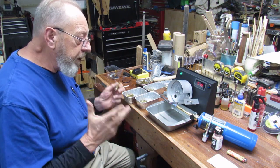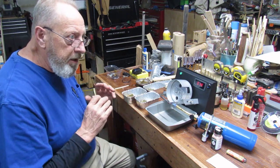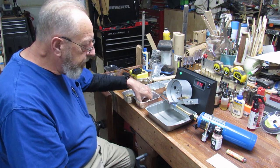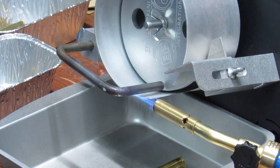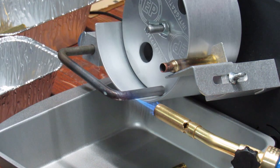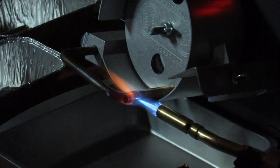This is just a short video to finish up the review — it isn't meant to be a step-by-step tutorial. This thing works really good, really easy, really simple, and simple suits me just fine. The more complicated you make things, the more errors get introduced. You just lay the case here and, as his videos show, it falls right into place. You want that flame tip right in the juncture and as it turns red, the case falls out of the annealer. I'm going to have Nick turn the light off so you can watch it turn red.